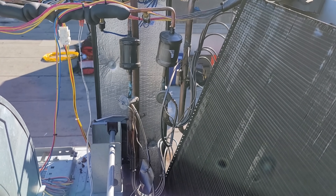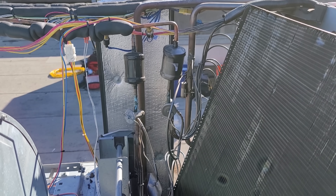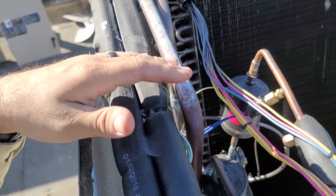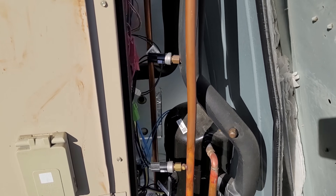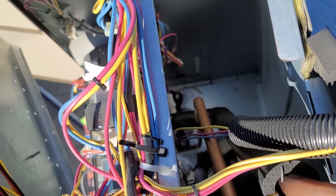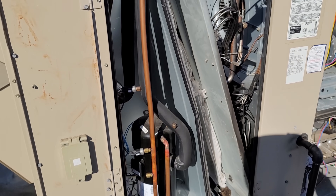If you look over here, this is what we're going to be working on. The equalizer line broke off right there. I'm kind of bummed out with how much everything's shaking in there — you can see it's just rubbing on the evap coil, it's kind of trash. At least the blower assembly is nice and clean. One thing about the Lennox units is they don't give you a lot of room to put a suction dryer. Ideally I'd put it right here, but that's not going to fit. It'd be a pain for someone to have to replace it ever.